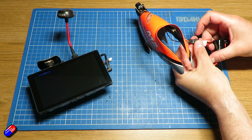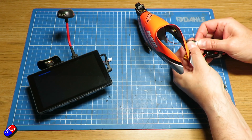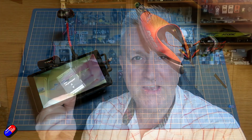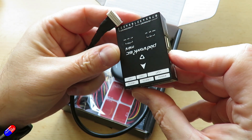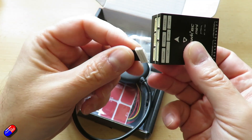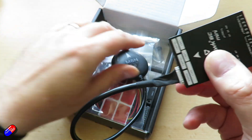I want to play with Arducopter because it will run a helicopter, and if I can get it all working I wouldn't mind putting some FPV gear on there as well. The higher-resolution, more performance-oriented cameras tend to get affected by vibration more than lower-resolution ones, but it should be an interesting thing to do. Essentially turning this into a flybarless unit, able to park the helicopter in 3D space, do return-to-home, fly missions — that could be a lot of fun. We'll figure out the CCPM mixing and get a little helicopter flying with the Holybro Pixhawk 6C Mini.